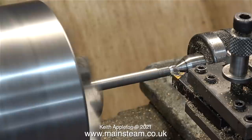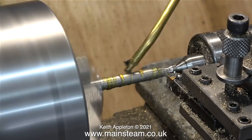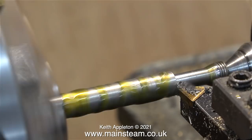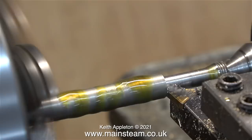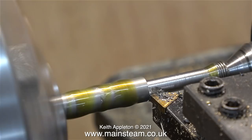I've already center drilled the piece of bar and the part furthest from the chuck has been supported by a live center. I can't take really deep cuts — if I do, the center part of this hinge pin will start to move away from the cutting tool once it gets a bit thinner. As usual, I'm using superheater steam oil as a cutting lubricant because it's very sticky and doesn't fly off all over the place.